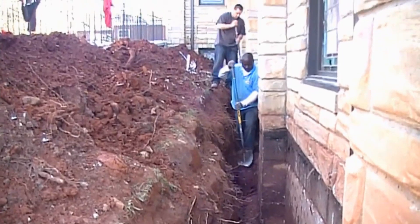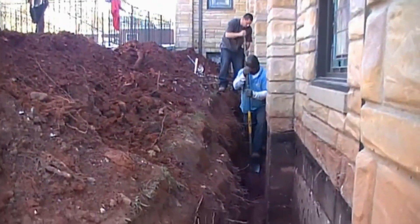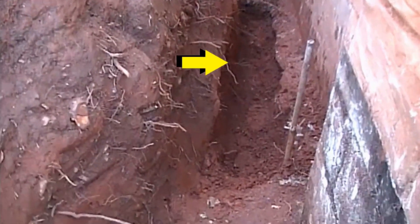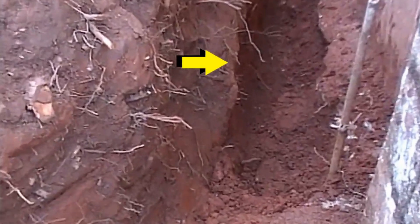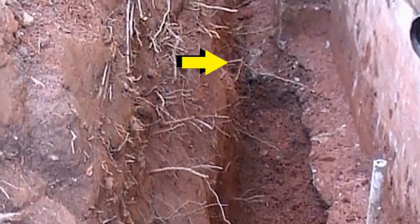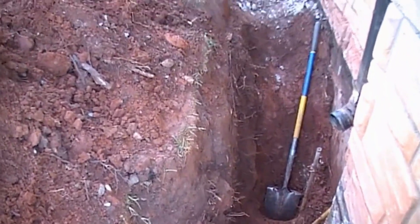This takes some time. I've got four guys out here digging and we're doing this by hand. The soil is rock-hard clay and we are digging this down. You can see we've got down to the footer — when you find the footer, there's no doubt that you've found it. We need to lay our footer pipe alongside the footer and this is going to have a sump pump to lift it up and send it out to daylight. Our notebook is filled with how-to tips and things that work and things that don't work. Can you see the downspout drain? This downspout drain probably caused more problems here than anything else — the downspout drain was just splashed out onto the ground. All of that water from the roof — remember, this is a church with 8,000 square feet of roof — came right down into the basement. The downspout drain is the most important drain in any rainwater drainage system.